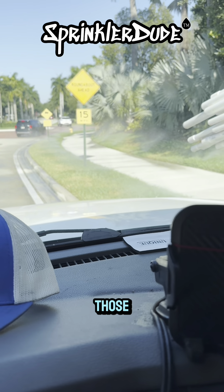He can't just drive by in a van and look at it — he's got to see it in person. All the pressure is coming out from this broken pipe here. We would have to fix the broken pipe to increase the pressure so we'd be able to see the rest of the zone. If we flag all the heads that look broken right now, we might be flagging heads that are not really broken — it's just not enough pressure because of this broken pipe. There is a sprinkler under there; there's just not enough pressure to pop it up.